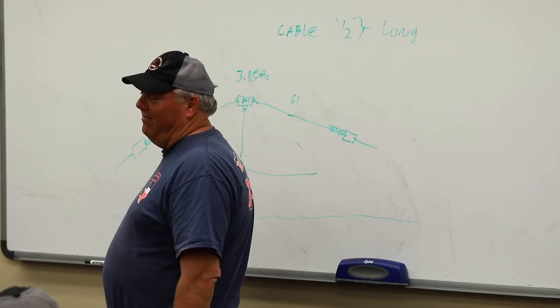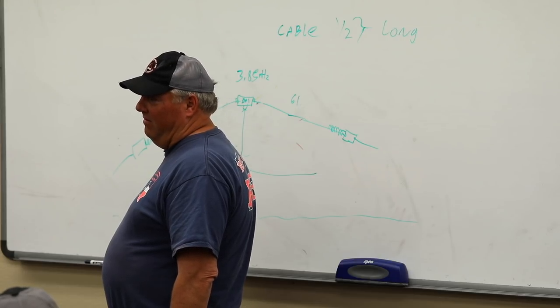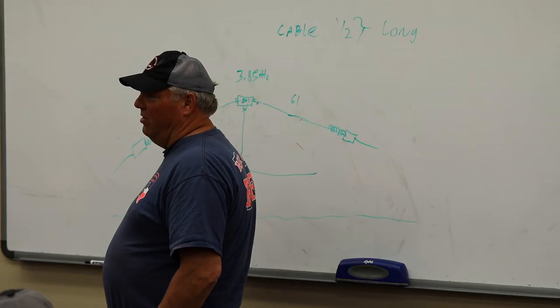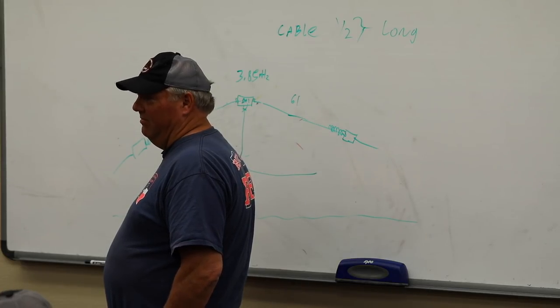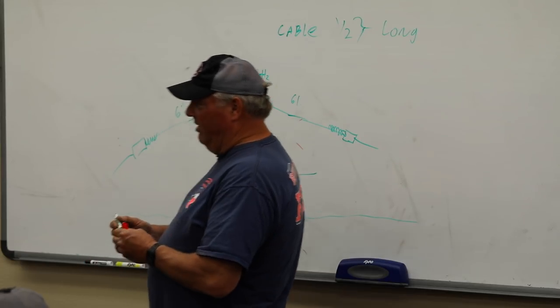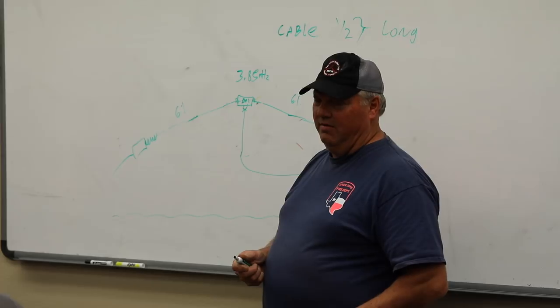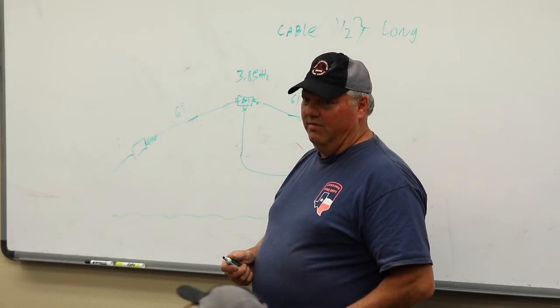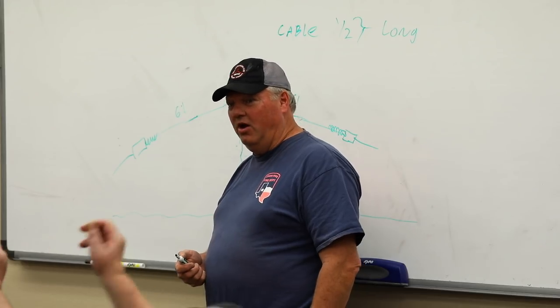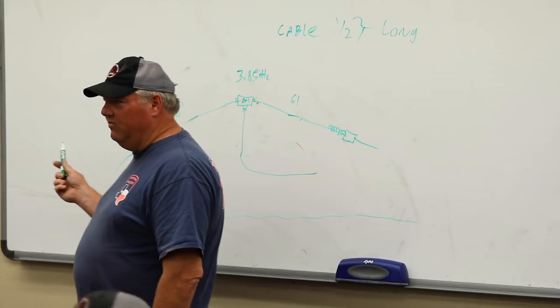It won't help it. No, but I mean, if it was way out of whack, would it induce energy in other places you don't want it? See, RF can go places you don't want it to go, and things aren't right. You figure it's that, can you read 18.5 feet of the coax? Nope. 18.5 feet on 80 meters is like, holy cow, can't use it.